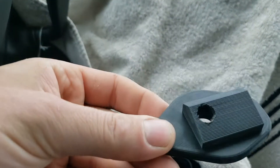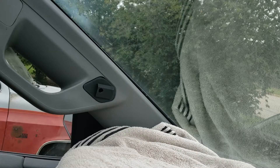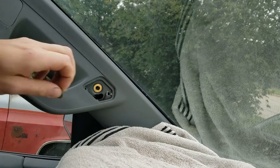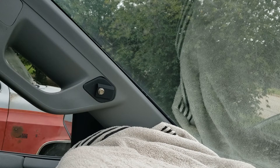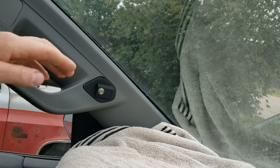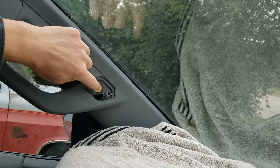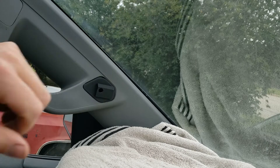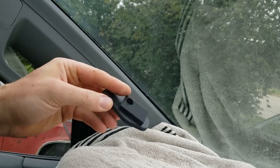I drilled a hole through the first pad mock-up piece to figure out how to mount it, and you can see it fits pretty good. That confirms I got the hole in the right place, so I can measure where it is and transfer it into FreeCAD — the next print will have the hole included so it won't have to be drilled. I'll be using a threaded rod: put the threaded rod in first, put a nut on so the handle is tight, and then the pod will slide onto the rod with a nut from the inside. I'll take some measurements, add a pod to this thing, and print off the first prototype.